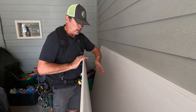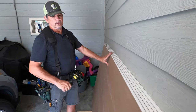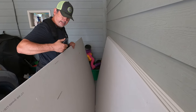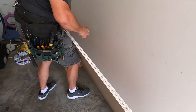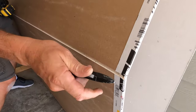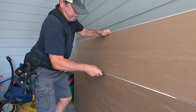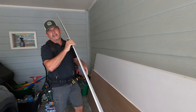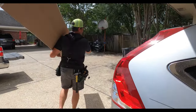All right, so we stack our drywall good side to good side, back to back. So on this particular sheet, I'm working from the back. On that sheet, I'll work from the front, but it doesn't matter. Pop it, let that fall. And then I get my knife in here and cut through to the paper side. Should be it. Yep. Now let's cut it to length. We're 88? Yeah. 88,